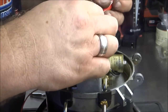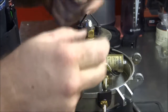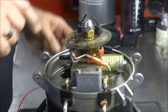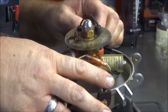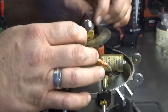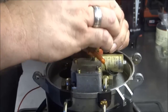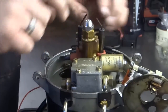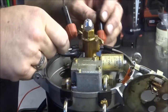You want to take a little screwdriver and work up to get this little snap ring off that holds this floating photo cell disc on. Just set that aside. Then you want to take a 10-millimeter and on this other side over here is a clamp that holds the electrodes. In my last video I showed where you pull a little side gauge off and set the distance on these electrodes in relation to the nozzle - now that I've disturbed that, that's going to have to be set again. I'll show that again - it might be a little easier to see here on the workbench. So now I'm just pulling my electrodes out of the way.